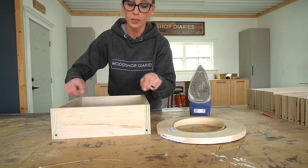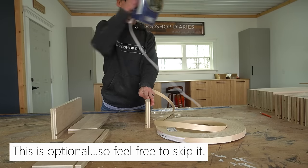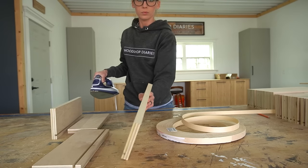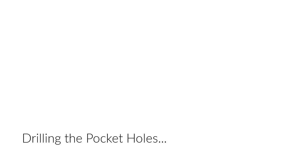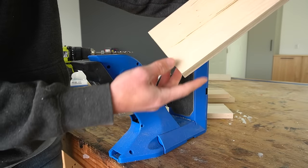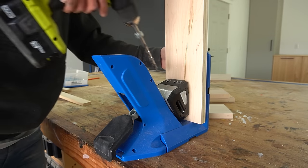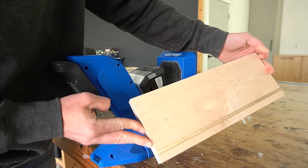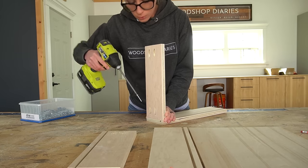Since I'm building my boxes out of plywood, I know I'm going to see the exposed plywood edge around the top of the drawer box pieces, so I like to apply iron-on edge banding to the top edges. The pocket holes will go on the opposite side as the dados, because the dados will face the inside of the drawer and the pocket holes will face the outside. The pocket holes are drilled in the front and back pieces, not in the side pieces. Now that all the pieces are edge banded, sanded, and prepped, it's time to actually assemble.